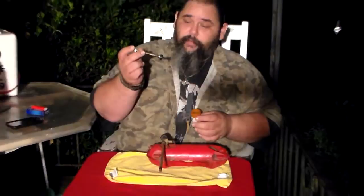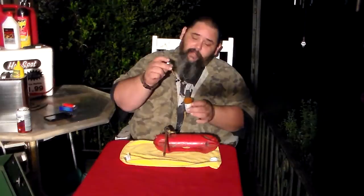We'll take this — this is the part that's our problem. It's just dried slap out. Formed leather, a few years not being used, not being taken care of, it dries out. All we do is take our pump and put the leather in. If this is the first time this is being done and you've got one that won't make pressure and you don't see any holes or tears in the leather, sit it in here like this and walk away.